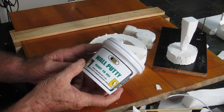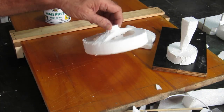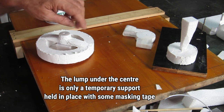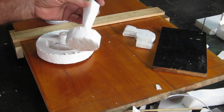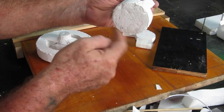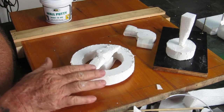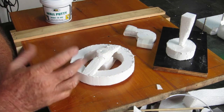I've tracked down some acrylic wall putty and I've put a very rough coat around the top, around the outside. It's hard to put it on in nice even coats and you'll get daggy bits on it - we'll sand all that off. This is the one for the micrometer ring; I've just put some around the top and around the outside and I'll put some on the bottom when that one's dry. If it comes out the way I suspect it will, it'll be well worth it because I should have nice smooth finishes that just need polishing up a little bit.